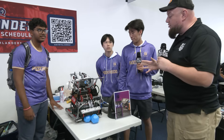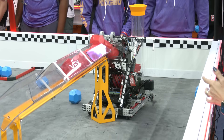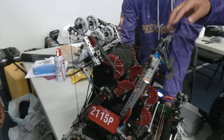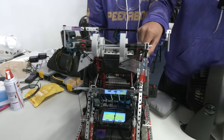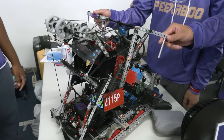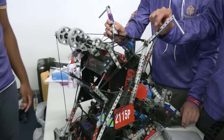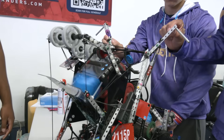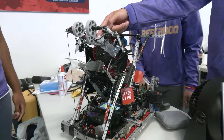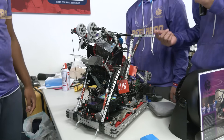Daniel, let's dive right into this robot. Talk to me more about the ball retention and why it's been so important and successful for your team so far. For ball retention, it's these plastic poly flaps here. These flaps are stringed and connected all the way over here — they're string-routed to these horns. So when these horns go up, it pulls on the string, which pulls the plastic pieces in and it just blocks the balls from going out. When it deactivates, the piston goes down, the flaps become loose and are able to form any shape they want, and then the balls can just freely slip through.